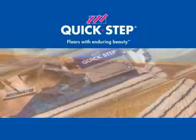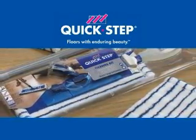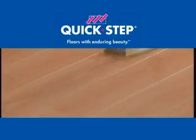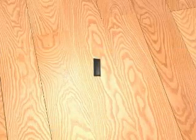Always prepare your floor by cleaning with the Quick Step Cleaning Kit. This will help to prevent damage to the existing flooring and ensure that the tape remains firmly in contact with the floor. Place a piece of tape on the plank that you want to remove.